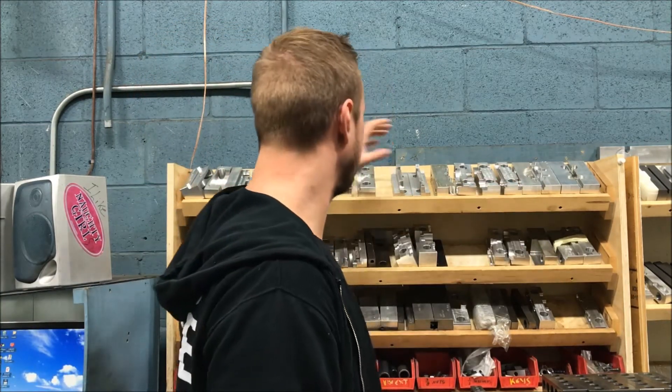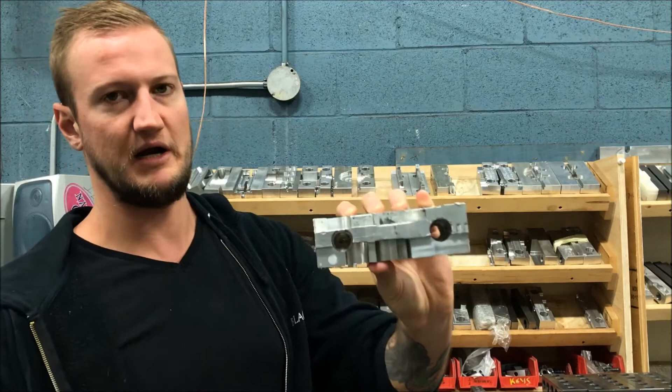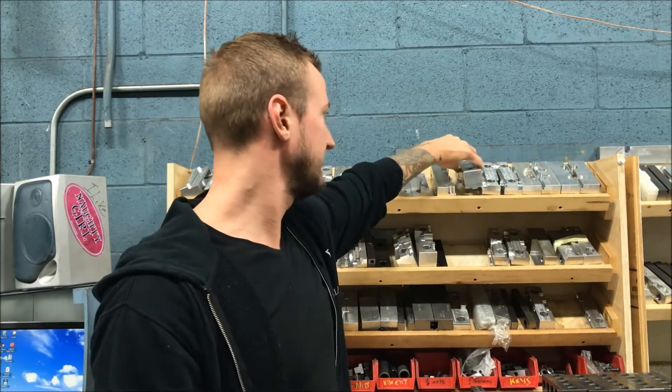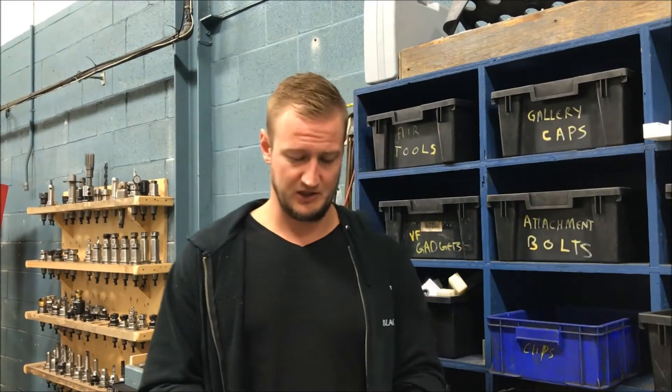The negative to these is that they do break down. You can see in here some of these parts — whether they're laser cut or flame cut or whatever — these jaws will break down. If you're doing hundreds of parts regularly, you don't want to use these. These are good for if I have a job come in and I need to quickly make step jaws and run it off. If I have a round thing, I can put it in there, hold it, run it off. But it's not good for a production run where I'm going to be doing 10,000 of things over a few months. In that case, I want to make steel jaws.